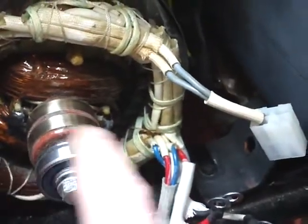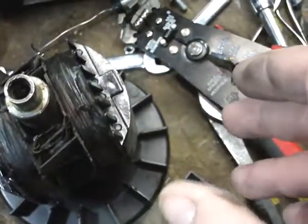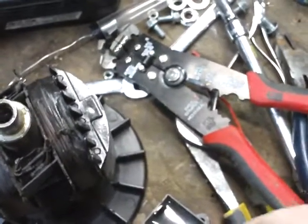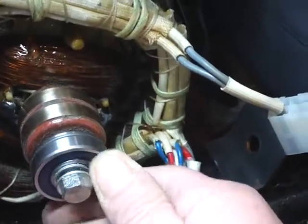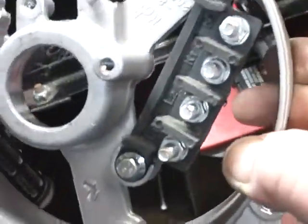I've let a brush-type generator sit for well over a year and you just plug something in and it fires right up. With brushless generators, a lot of times you actually have to flash the generator. The way I do it is plug in an electric drill, put it in forward, spin it with the breaker on, and it'll take off and go. With brush-type generators I've never had one lose its flash — they are a lot more resilient.